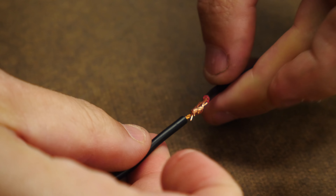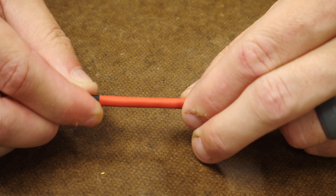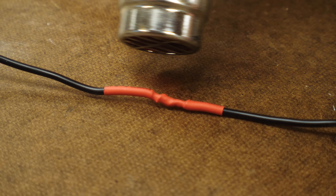If you're not fixing an electrical component to a board, you may just need to connect two wires. In that case, you want to twist them together and then solder them. But you don't want to leave that exposed — you need to insulate it with electrical tape or put some heat shrink tubing around it and use a heat gun to close it in.